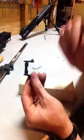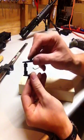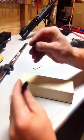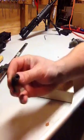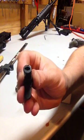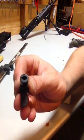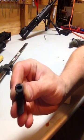The problem is, if you see right there, I'm not getting full insertion of the right-hand side of the safety selector, which is for the left-handers, into my safety selector. So I apologize to all you guys out there who love Rock River. I've heard great things about them, but this machine part sucks. What you can see is there's kind of a little keyway there, and that's a pretty good shot right there. You can see it's offset, and I'm not sure if my video is going to look left or right to you guys. But the way it is, when they machined this, their bit was a little too far off to the left.